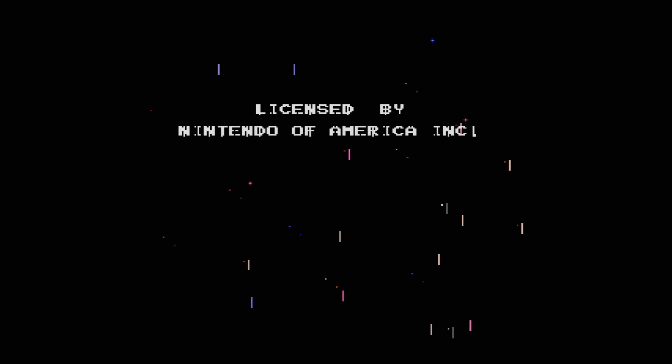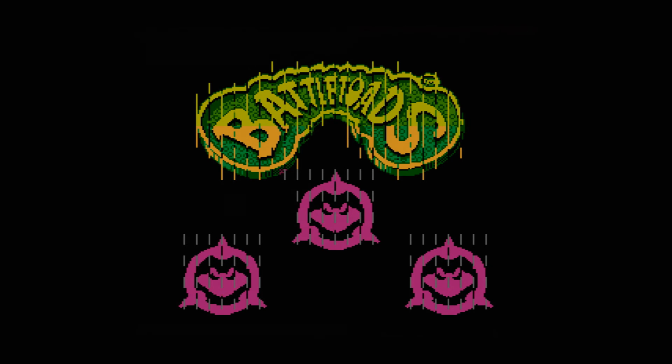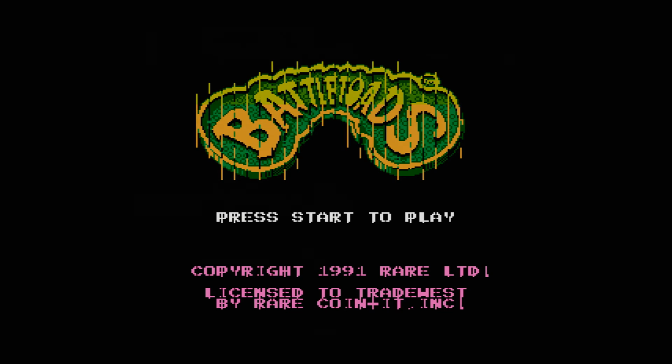Oh, that's not good. This is actual video footage of the first time I turned it on. I was concerned, but I wasn't too discouraged by this because the worst case scenario isn't corrupted video, it's no video. If you really look at the video, you'll notice that it's sharp with some artifacts over the sprites. My mind returned to that damaged leg of the PPU. I thought maybe something went wrong when I formed that bridge out of solder.